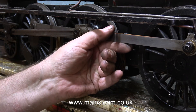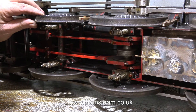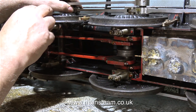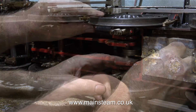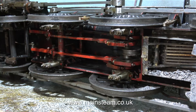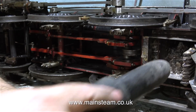The rods are not bad at all; there's some side movement — there has to be — but generally the bearing fits are quite good. If the coupling rod and big end bearings are too tight, then the suspension will not work correctly, and the engine's likely to derail and won't like going around corners too much either. Steam locomotives are always a bit of a mechanical anomaly. On the early locomotives they had ball joints — I think on the Rocket they had a ball joint on the end of the connecting rods. But later locomotives did away with this, and it's all down to bearing tolerance and clearance.